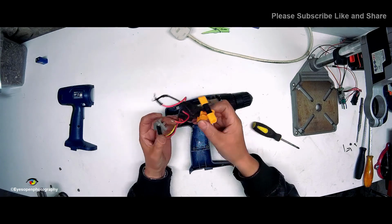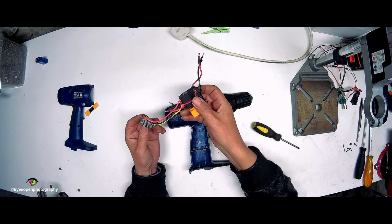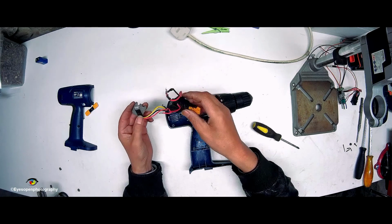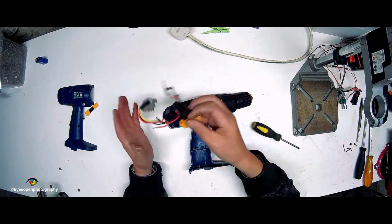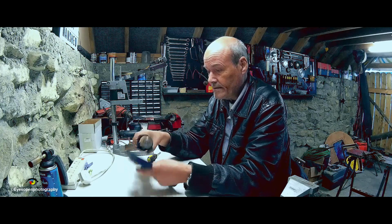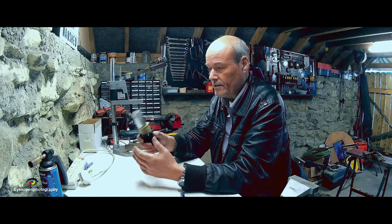And this is the trigger section, and I have it unsoldered from the actual motor at the back, right? And it's this guy that's gone faulty. Now yes, I could look up this component and buy a replacement or equivalent, and it would probably work, but I think I saw smoke coming out of here as well, so I wouldn't waste my time with it. So this is the gearbox, the motor and the chuck all combined, and I do know that this is working.